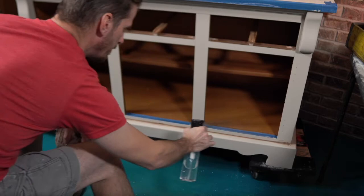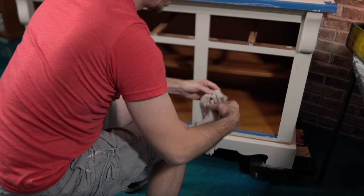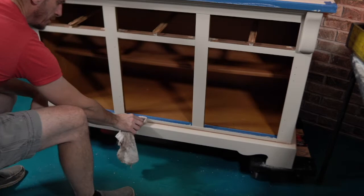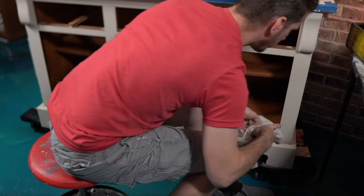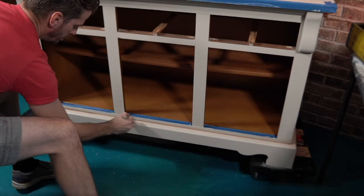And I tell you what, I'm going to reverse what I did on the other side. I'm gonna wipe first just to get off the excess because I was kind of fighting it. Now I'm gonna go back to the Belle brush and do the final softening. Looks like I kind of went around the corner there. This can be done with the French tip or another 1 inch small.